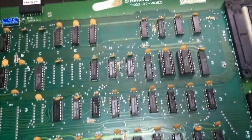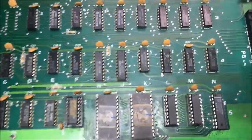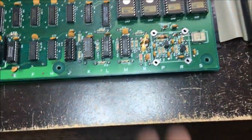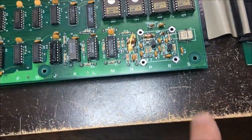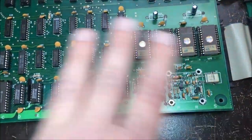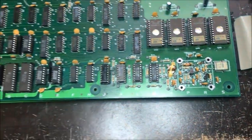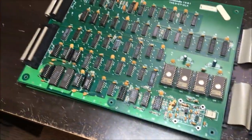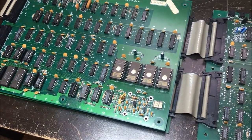All right, but I'll continue on with the video board. I'm gonna work the video board because I know I have issues getting to the RAM with the Fluke. And now I know the RAM are good. It wasn't the RAM and it wasn't the 245. It's the surrounding circuitry involved in that circuitry that is bad. So I'll find that.